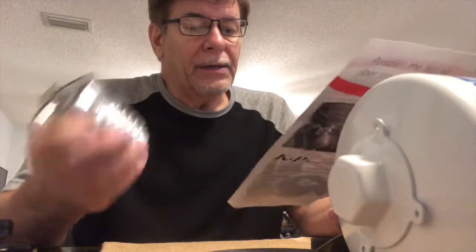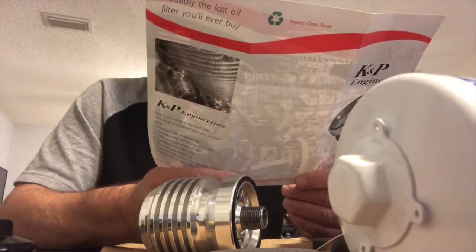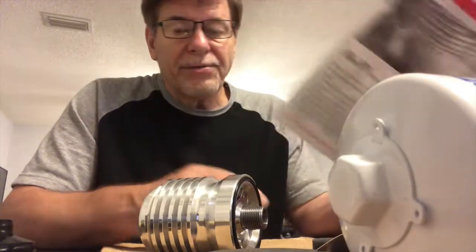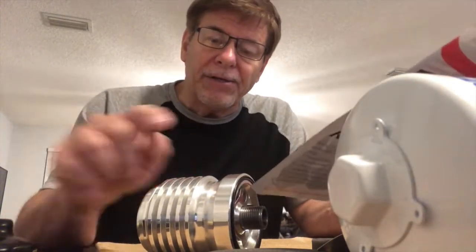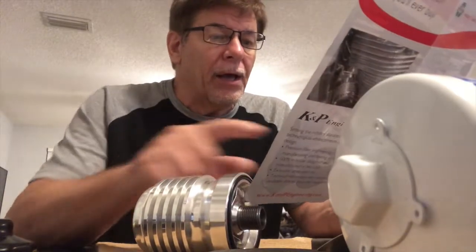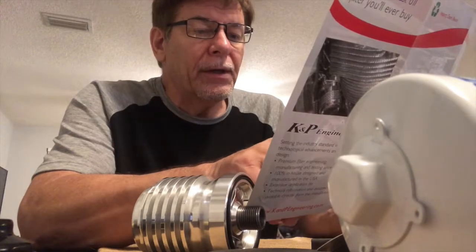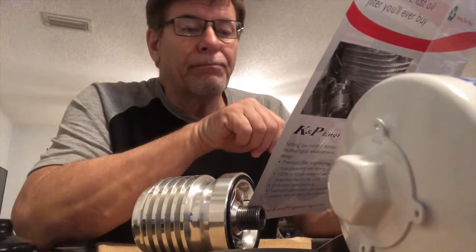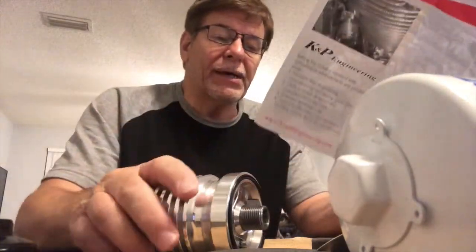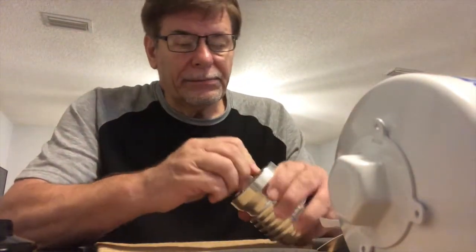That's what the company claims as well — you get oil pressure a lot sooner. One square inch of this kind of filter with only one psi pressure is supposed to flow 1.9 gallons of oil per minute. That's pretty impressive — no wonder you get oil pressure quickly.